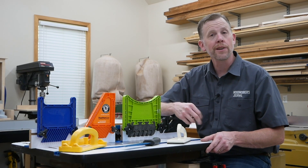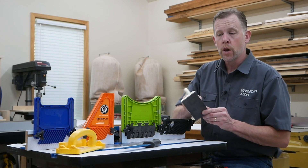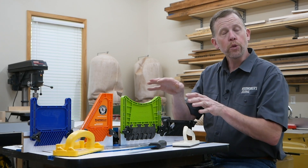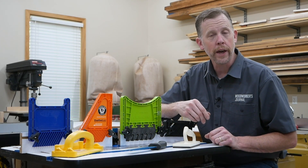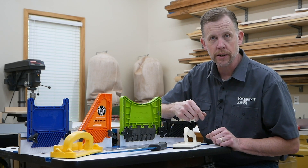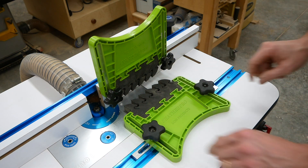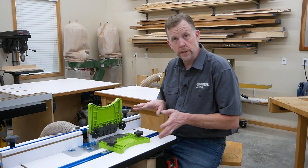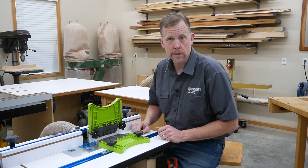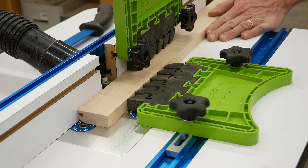My fourth suggestion for accessories also has to do with working safely: a pushing device of some sort, whether that's a push pad or a push stick, and feather boards. Both of these will help keep your fingers out of harm's way, but they'll also help you better control your work pieces for more consistent and accurate routing. When you're choosing feather boards, buy a pair of them that can be mounted to either the fence or the miter slot. This way you can press work pieces up against the fence or down against the table, or both, depending on the circumstance. They'll help ensure that your bits can cut properly and they'll also keep your fingers safe when you're routing narrow work pieces.